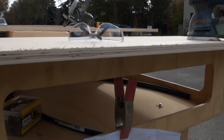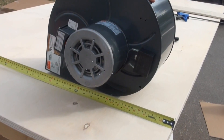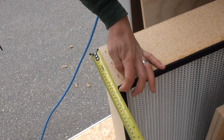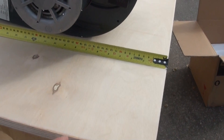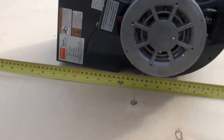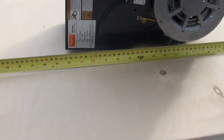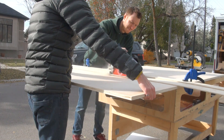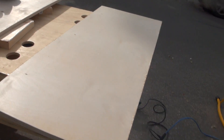When you're trying to determine how big your box needs to be, you have to think about the fan sitting on top of the box — you need at least six inches for your filter. Some filters are even bigger, up to 12 inches, but the one we have today is only six inches, so the outlet of the fan has to sit at least six inches back. The top of this box is going to be 20 inches wide, which will give us plenty of room for the filter and for the fan to sit right there.